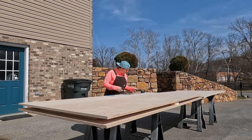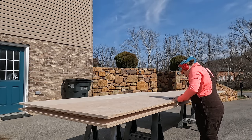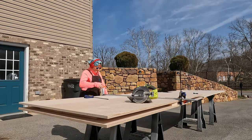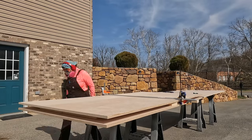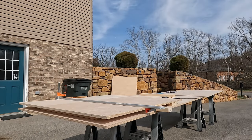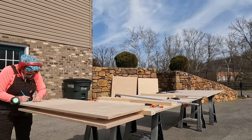I decided to get started by basically just building a couple different sets of cabinets. To get those cabinets built, I used about three sheets of three quarter inch sanded maple plywood. I started by cutting these plywood sheets down into more manageable sizes. Once I had that done, then I could get started getting everything to its final dimension. Now I planned on painting these cabinets,